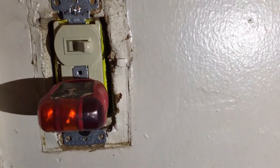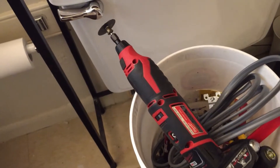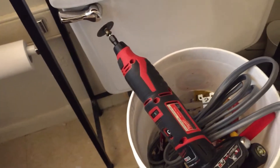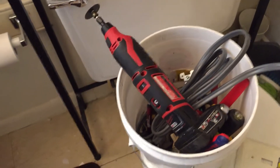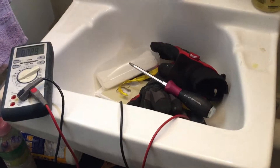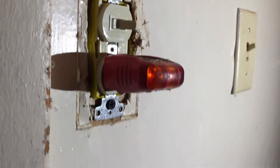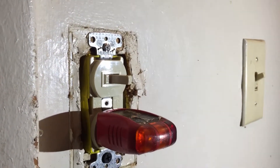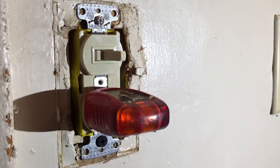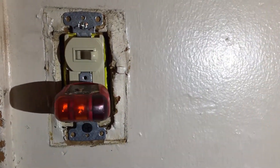Two more problems with the tape — the device did not want to fit in the junction box. I had to take a tool and grind it out a little bit to get it to fit — the second time that's happened to me. There are other ways to do this but I figured I'd let you know. Now I can get out of here and put the cover back on — it's flush the way it's supposed to be, but it did not want to fit in there just because I had tape wrapped around the outlet. I'm happy — it's good to go.